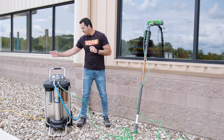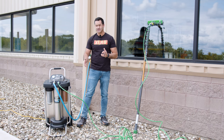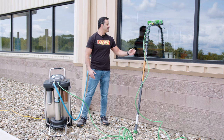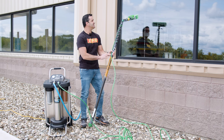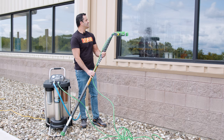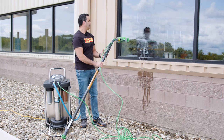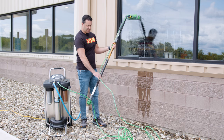We're going to start producing water here. The wastewater is flowing, the gallon meter is going, the PSI gauge is giving us a reading, and we're in business. It's running through all three filters and we should begin to see water any second. This is the flow you can expect when running the booster pump — as you can see we're using the rinse bar.